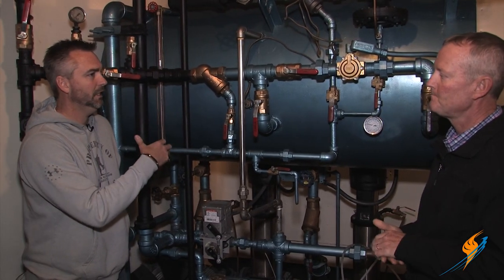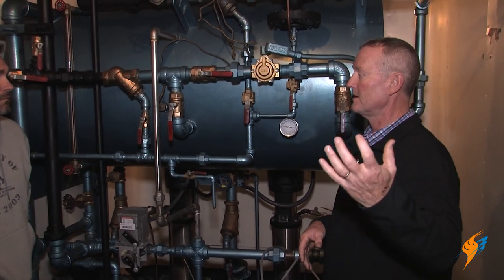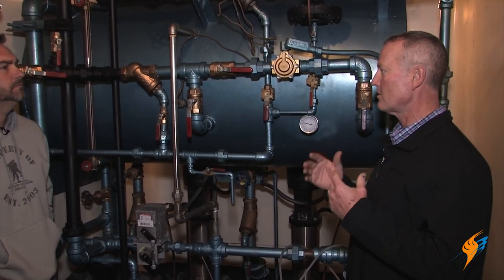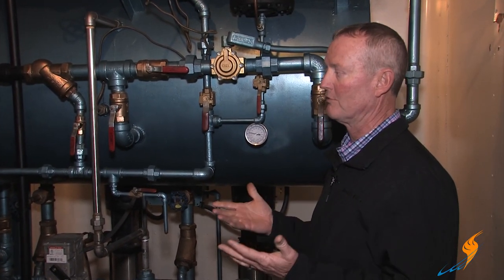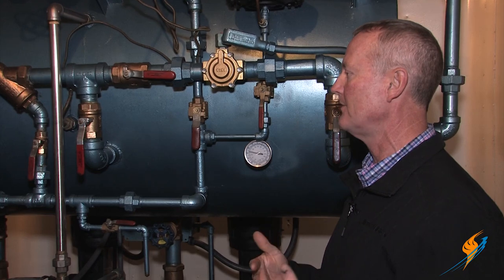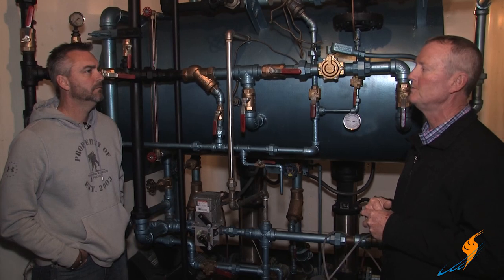Once you do that sulfite cleaning, you introduce it into the boiler — that's going to create a little bit of sludge, which has to be blown out during daily blowdown. So why a deaerator versus a condensate system — which one do you pick? Most of the time you'll see a condensate system on smaller systems; a lot of times it's strictly capital. The deaerator system is probably three times the cost of a condensate system. If you've got a lot of return coming back, that return water is already treated with very little oxygen, so it's not nearly as aggressive as soft makeup water. If you've got a lot of soft water or makeup water, you really want a deaerator system. The big thing is preheating the water — you certainly don't want to introduce cold water into a boiler. It will shock the boiler and jerk tubes loose from the tube sheet.